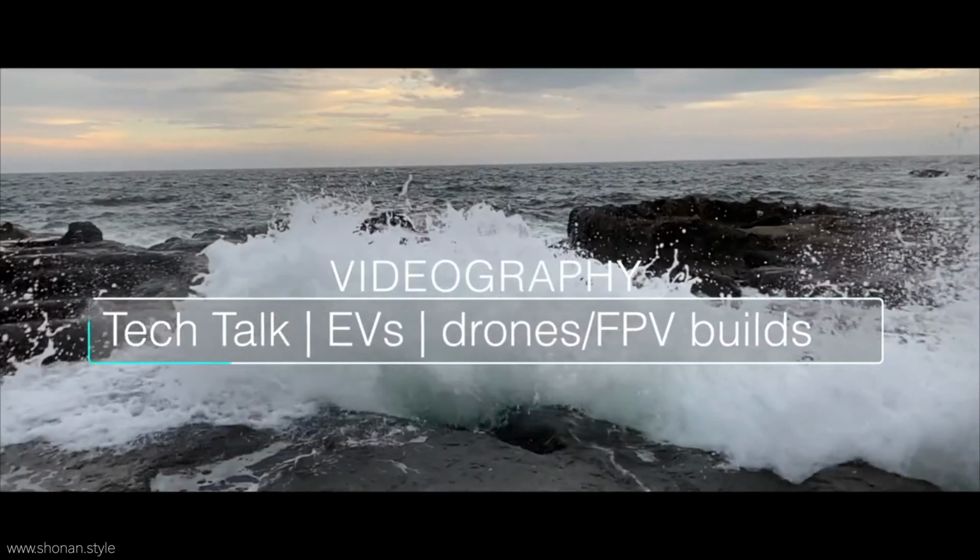Here we have two smaller engines with 1300 KV and 1000. So they are actually the same, just the KV value is different for testing purposes. They're very light. Without any mount, it's coming in at 55 grams only. And with the mount and some assembly, 60 grams. But this one here is basically the one I have as a favorite pick. I will try a 1100 kV engine, much smaller, but a full assembly comes in at only 81 grams.